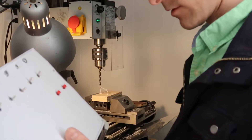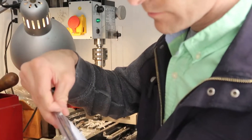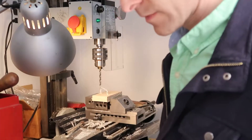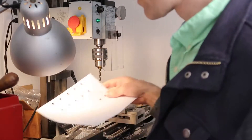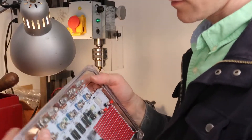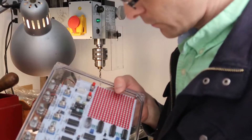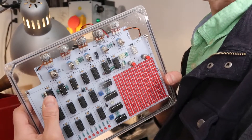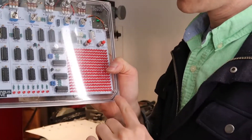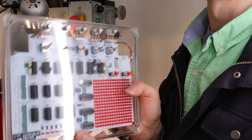Let's go ahead and pull this tape off. I didn't drill the tiny holes yet - I'll use the alignment of the circuit board to show me where to drill those holes by hand. I won't bother with the template for small drill holes; it's too prone to error. I highly recommend over-drilling the hole sizes so that you have enough room for these things to fit. These are just a little bit oversized, not too much, and it looks like everything will fit in here just fine. For the corner holes for the circuit board standoffs, I'm going to mount all these parts first and then use a marker to mark where each one of those holes is, and then I'll drill it by hand.